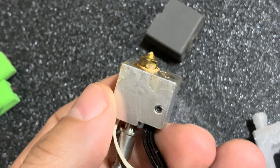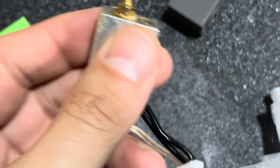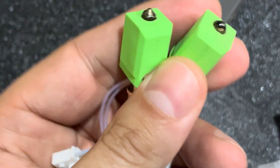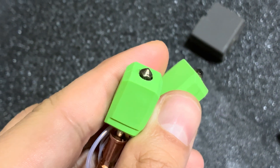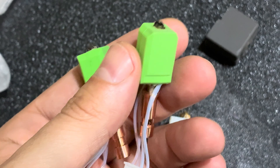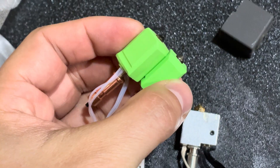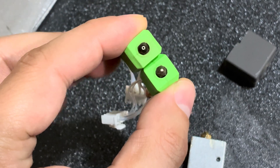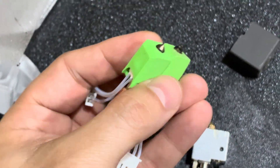This here is the stock nozzle. There's some filament on it because it kept dislodging from the print bed, which is why I used glue. Normally it's perfectly clean with no filament on it when printing. With these bi-metals, the filament really gets stuck and pulls around. This is a clean version; this is the used version with some black Elegoo Rapid PLA Plus on it — not ideal. This has issues with top surfaces not coming out as clean as with the stock nozzle, and it collects filament over time. Overall, I'm not happy with the print quality on top surfaces and first layers with these.